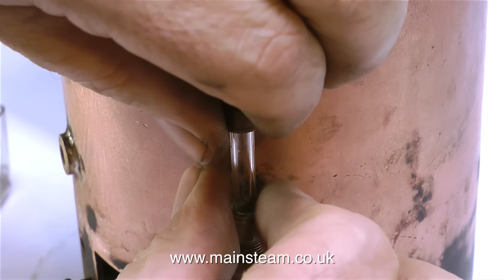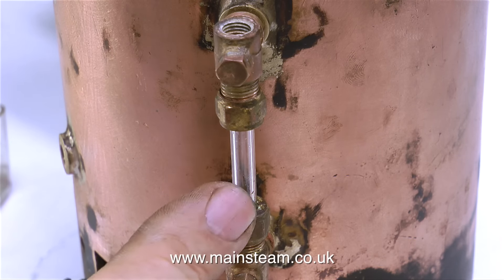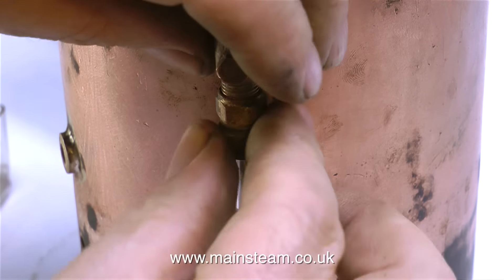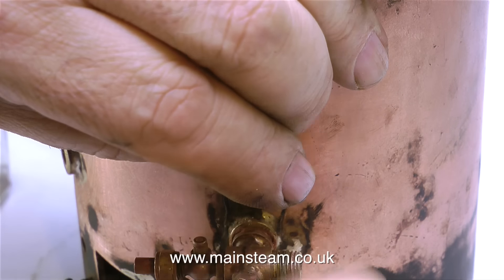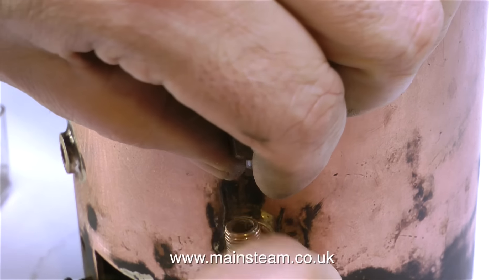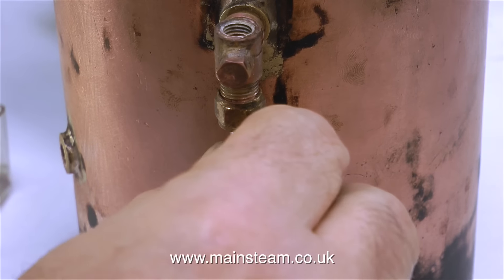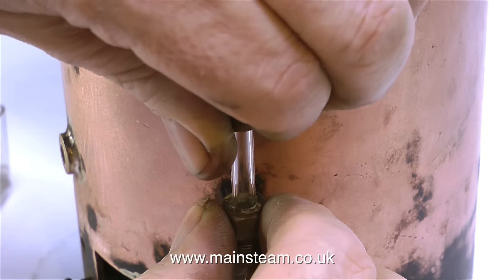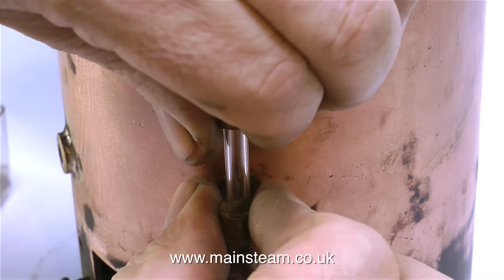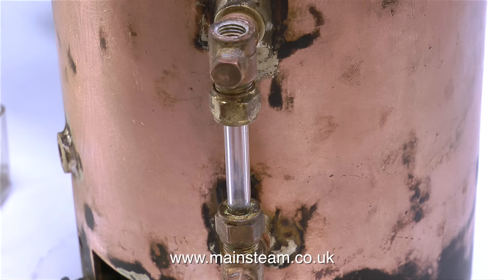As I said at the beginning of this section, this is not a proper fitting — it's just a dummy run to show how to do it. The good thing is that now I have a ready-made water gauge glass which can be fitted without trimming once I put the gauge in place permanently. The first thing I would have to do is make sure the alignment was perfect. Here I'm rotating the bottom fitting to check the general alignment of the boiler bushes. In many cases on homemade boilers, and some proprietary ones, the boiler bushes are not in line on the water gauge. Because silver soldering is a very hot process, all of the boiler parts do move around somewhat during the silver soldering process.